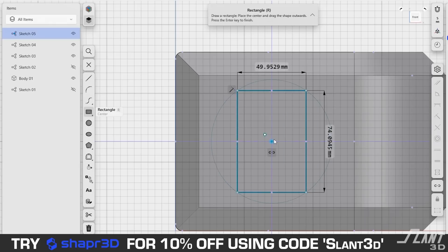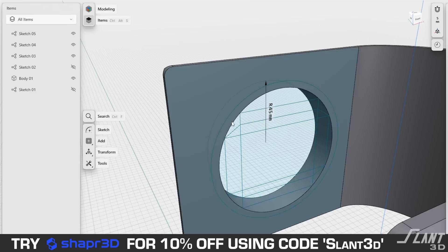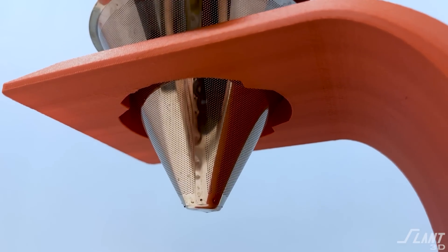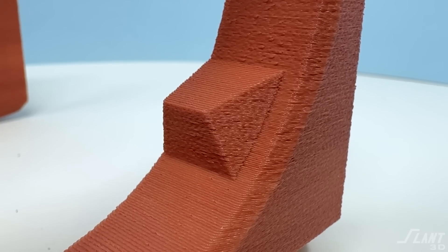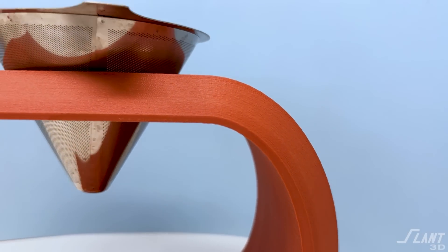Looking at these teeth: they come in from four directions. Normally something pointing down at an angle like this would need support itself, but we created overhang supports underneath here and chamfered them so they come to a point at a kind of weird oblong angle, mirrored on the bottom, so you can't tell it was intentional. By creating that symmetrical geometry, you get the points that separate the filter from the printed part. When the filter is plugged into the top, wherever it touches the plastic, water and surface tension will pull liquid that direction, potentially causing leaks around the side of the hole rather than through the tip. Having those points guide liquid down ensures all liquid goes to the point of the filter for a smooth flow. As for texture, we added just a little bit of noise and used a wonderful terracotta color that looks really nice for a minimalist piece.